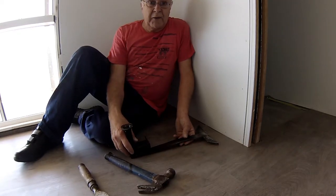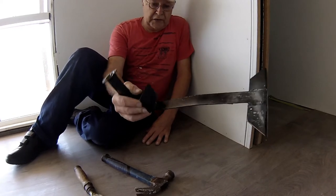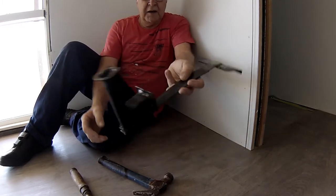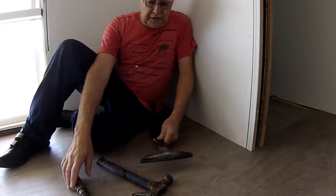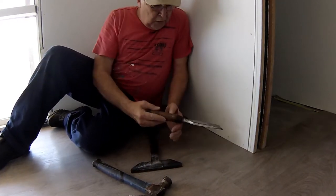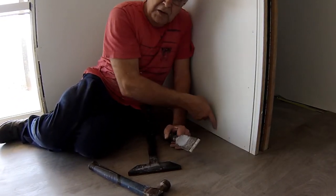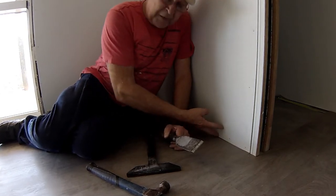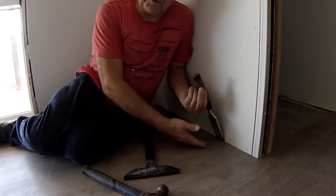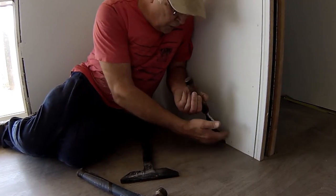And while we are going backwards, in the previous video I also mentioned and showed you one of these hammering tools that you use for locking in the ends of your laminate floor planks, and I did indeed make my own. The reason I did was I found there was a problem levering off the wall with the chisel where I was trying to do that where there was an internal sliding door, or a pocket door as you Yanks call it. The frame on these things is not very rigid, and when I levered, I wasn't getting the full leverage onto the plank because the frame of the internal cavity door was bending.